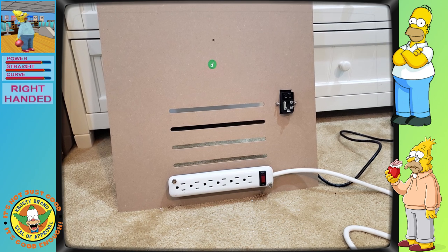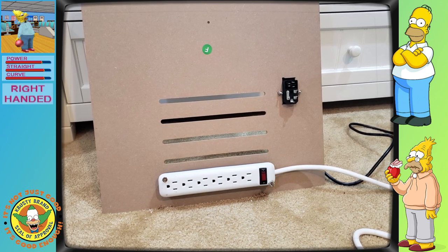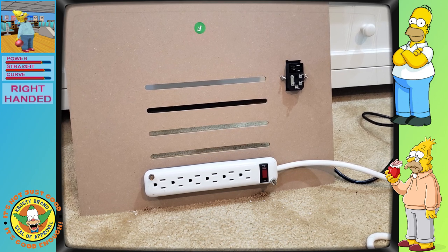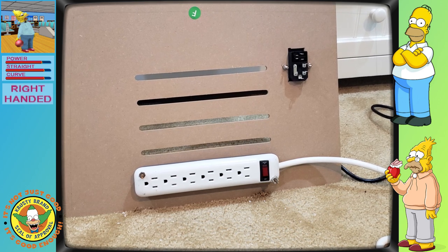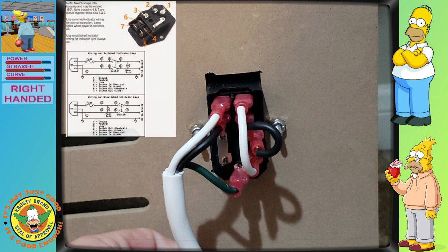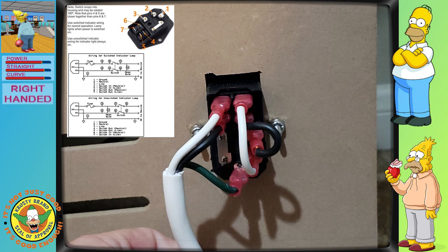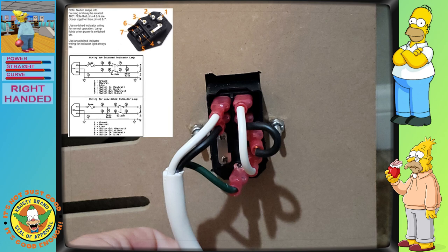Next, we'll take our newly modified power strip and use it as a guide to space out a usable location on the inside of the back panel on our Simpsons Arcade 1-Up cabinet, and we'll drill holes that match the mounting holes we just made in our power strip. Once done, run the bolt starting from the outside of the back panel and fasten the power strip down with corresponding nuts on the inside of the panel. If this is done correctly, we should have our power strip mounted on the same side of the back panel as the internal components of the inlet switch. It's now time to cut the plug off the end of my power strip and hardwire the cabling into the internal connections on the inlet switch. To do this, I'll be using a number of spade connectors. All of the internal connections on the inlet switch are male terminals, and to make reliable connections I'll be using female spade compression connections. I'll leave links for the parts I'm using in the description.